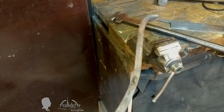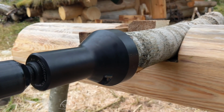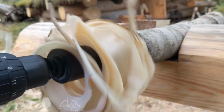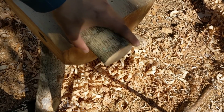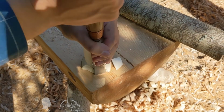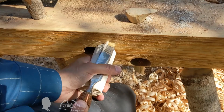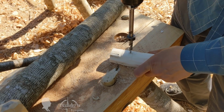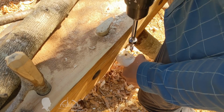The first year, I used the Cloggers knife without a wooden handle, which was a mistake. The maple handle significantly improved the maximum exertable force and the blade's control. Maple is the hardest wood I could find around here. Despite the fact that during the tool's transportation I knocked off the wooden handle from the tang, it has not cracked or fallen off during use. Again, I did not use any glue. I just drilled a hole in a wooden block and hammered the maple handle onto the tang with a wooden mallet. Simple and reliable.